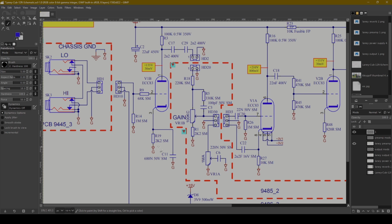Next, we've got a 2.2K bias resistor and then a 680 nanofarad bypass cap. So 2.2K is perfectly fine. 1.5K is usually a little more of a center bias resistor. So if you think about this as 0 and your guitar signal is doing this, the center bias means that this center point is there. You have just as much above as you do below the line.